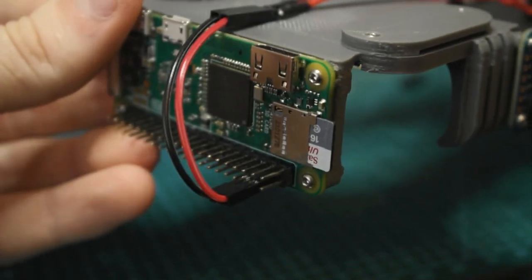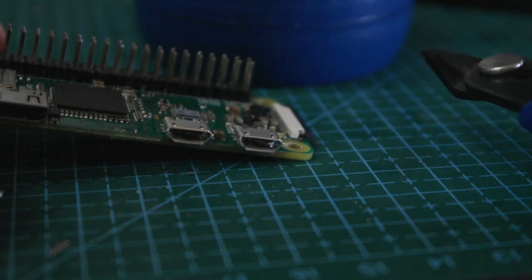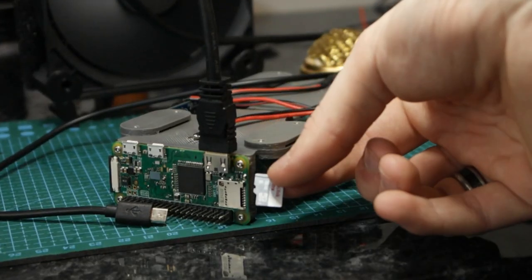I had just tried to power the Raspberry Pi along its 5V GPIO pins, which I wasn't sure was okay to do outside of vaguely recalling some forum posts I had skimmed over literal days ago. And as soon as I gave the line some power, I see zero activity from the Pi? That's not good. Turns out I hadn't actually broken anything, and powering the Pi like this would be totally fine so long as I didn't try to power it from the micro B port at the same time. Yeah, where have I seen that before? Just by some freak chance, or some forgetful occurrence, the micro SD card I was using was absolutely cooked.